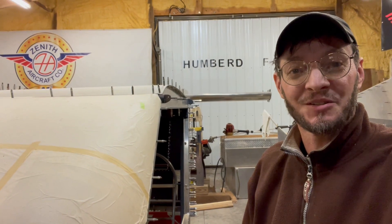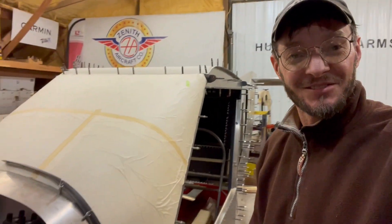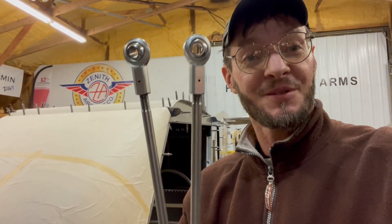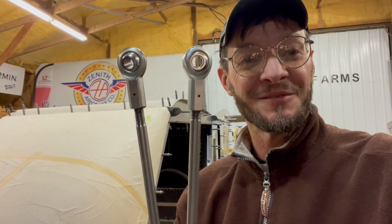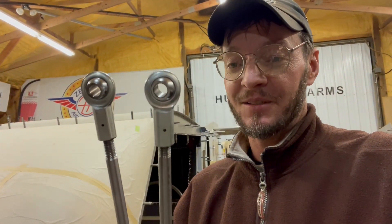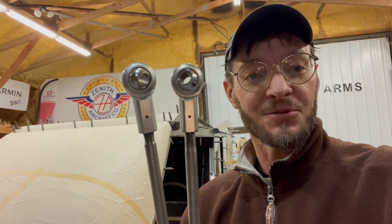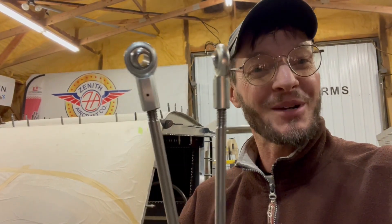Like I said, this old dude's kind of tired, but I haven't started on it yet. I'm going to try to make just a tiny bit of progress. What I did do — I'm still learning on this titanium, but I do have a couple of rods that are threaded now, so I've at least convinced myself it's possible. Definitely some technique and a lot of cutting fluid involved. What I've kind of learned is when it starts getting warm enough to make the cutting fluid start smoking, just walk away and let the whole business cool down. I'm not sure how the longevity of the actual die is going to be, but I'm threading titanium, so I'm happy.